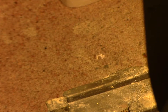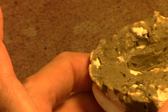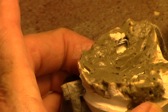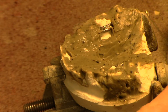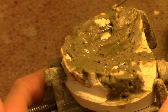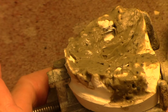Let me show you a couple of tricks. Let's do this quad helix — it's exactly the same design as the one we showed earlier. I'm going to clamp it in the stand. This one's got more wire, there's more to solder. One of the problems is getting the initial flow — the sweating — to occur properly. What you can do is take a wire and put just a little bit of solder on the end of it. As capillary action starts drawing solder into the joint, you can use this wire as a probe to kind of paint the solder over the wires and into all the cracks and crevices.